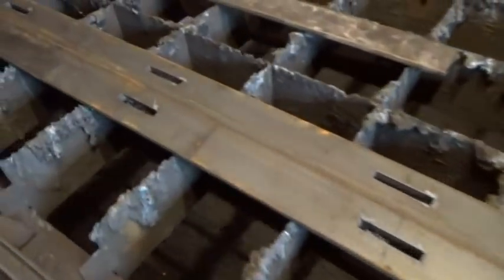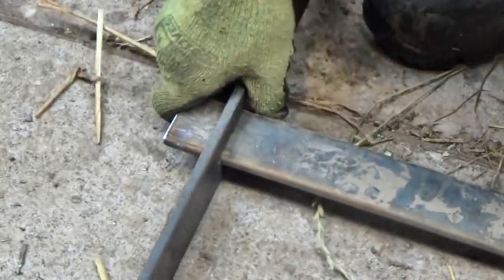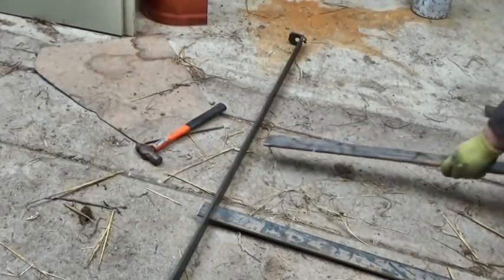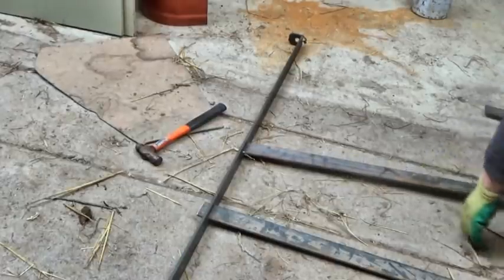These are what will sit over the hanging pins on the posts. But a freehand cutting machine could cut those slots too, just not as neatly. Or you could drill them out — something I would have done once upon a time. And the reason I cut those slots out was so that I could do this — almost like making a traditional mortise and tenon wooden gate.